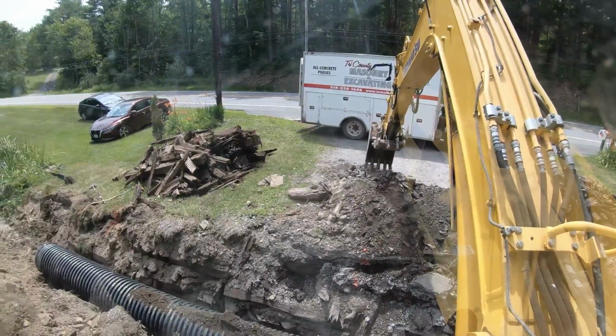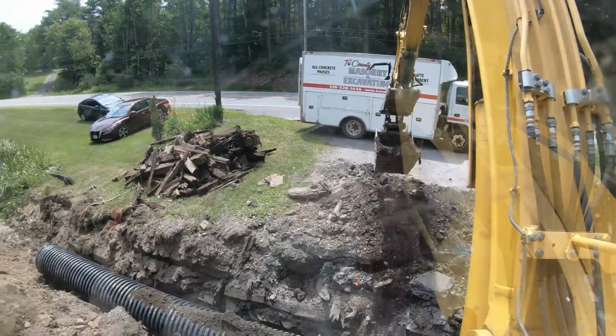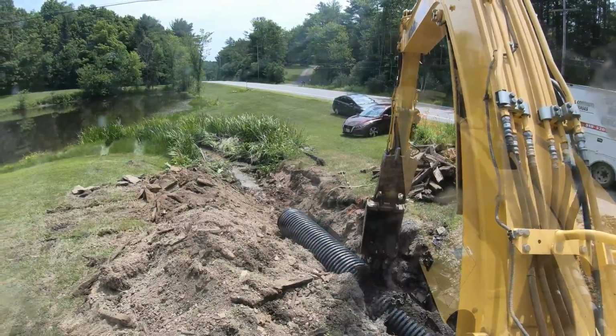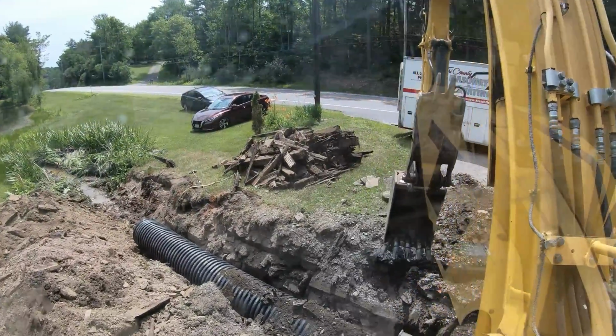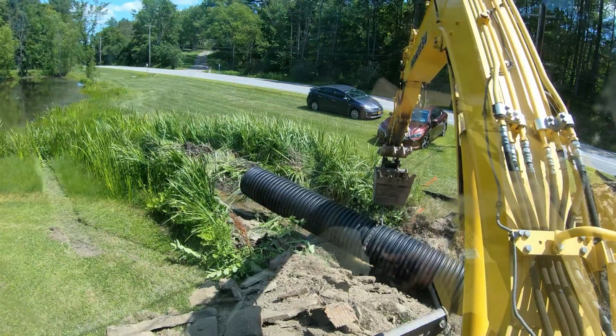You know, you get 6, 7, 8 inches over the top of that culvert, then I like to hit it with a tamper where the road area is, and obviously I would hit it where the dirt is also, because I have it here. Normally you wouldn't, you just track and pack that, but last piece of stick going in.